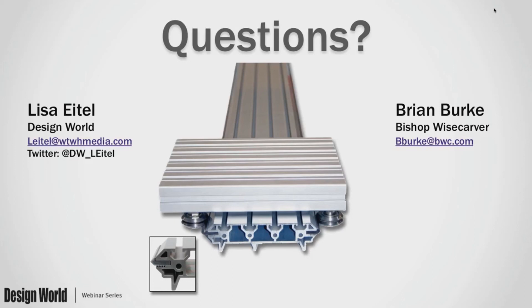What is the maximum length? You start getting into limitations with shipping. A typical truck shipment is about 50 feet long — approximately 52 feet inside the trailer — so that's about as long as you could do in a single piece. Our Dual V track is 20 feet long, so a typical extrusion would be 20 feet long and cut down to smaller sizes. In our LoPro product line, we actually attach tracks end to end for unlimited lengths — we have done actuators up to 80 feet long, shipped in shorter sections and attached in the field.